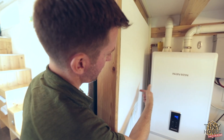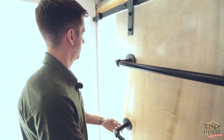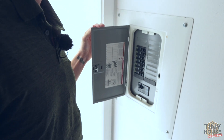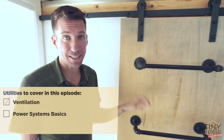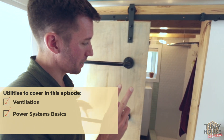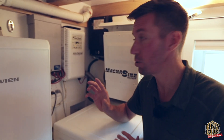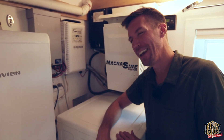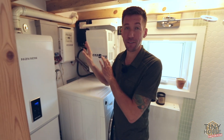From the inverter, power goes to the breaker panel on the other side of this wall. This wall is hollow, and when we roll open this door, there's my breaker panel — that gives me access to all my circuits throughout the house. There are only two things I didn't mention: the generator and a transformer. The generator outside can produce 120 or 240V. If it produces 240V, it can come to this transformer, be stepped back down to 120V, and charge the batteries twice as fast.